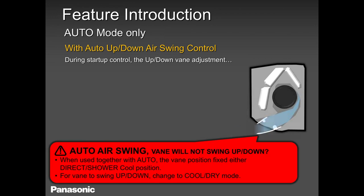Auto swing is a good function, especially when homeowners are complaining about cold draft in heat mode. When they're complaining about cold draft, tell them to switch from manual to auto swing. So what's going to happen? The louvers are going to shut, close when the unit goes into defrost. But when it stays open, there are big chances of that cold draft coming down when you're in manual mode. So my best setting in heat mode is auto swing and auto fan, but not auto mode. But again, if you want auto mode, it's there, it's up to you.